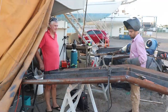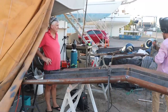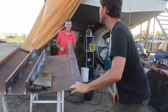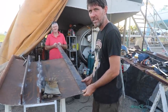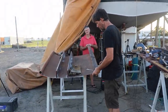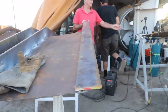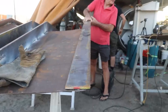Once we've got the trailing edge on, we can figure out the skin, and that'll allow us to figure out the angle. So now that we've got the leading edge on, which is this round bar, we're doing the trailing edge, which is as thin as we can reasonably make it. In this case, it's 6mm flat bar. It has to be at right angle to that 16mm beam there next to the gloves, so it sits off the steel slightly. We could wedge something under it and clamp.